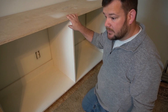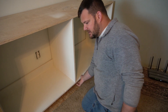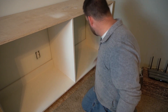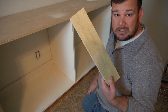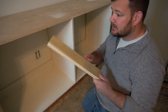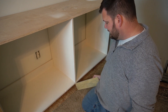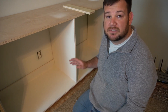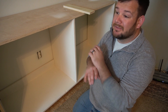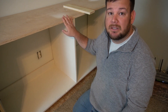Here's one of the lower carcasses, and once I got it in place I realized I need some center support so this bottom run doesn't sag. So I'm just going to use these simple cutoffs — three and a half inches by 16 inches — flip the carcass over and toenail that in place, and that will give me some middle support. Once these pieces are in place, the next thing will be to get these lowers in their final location so we can start building and assembling everything off from these.